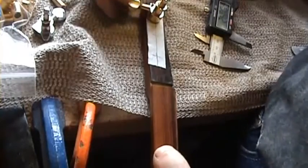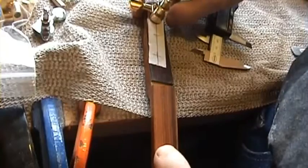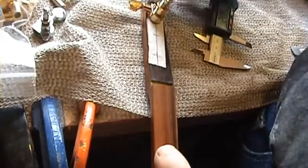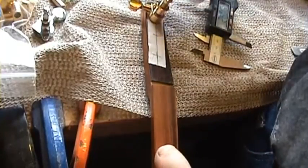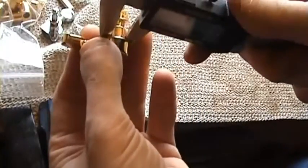So it's the final machine peg, which is on the smallest piece of wood. It's basically almost central. So there's wood on either side, so the hole will be supported, and you're not weakening the headstock by having a hole too near the edge. Say for example you've got a soft cedar or a soft mahogany, then you can make the hole midway, like this is 9.76 millimeters. So you would make the hole midway, and then that would be a nice push fit.